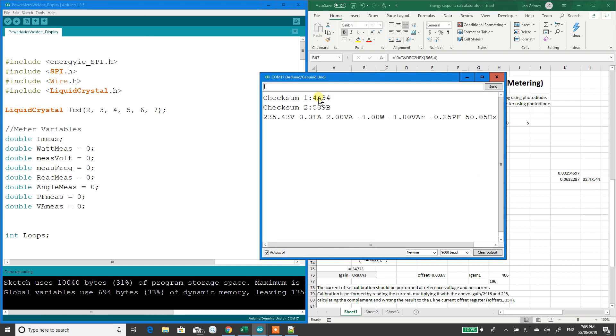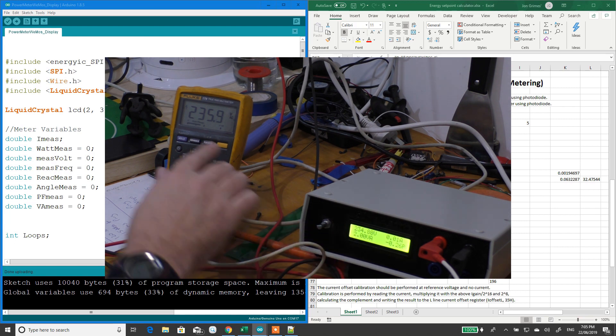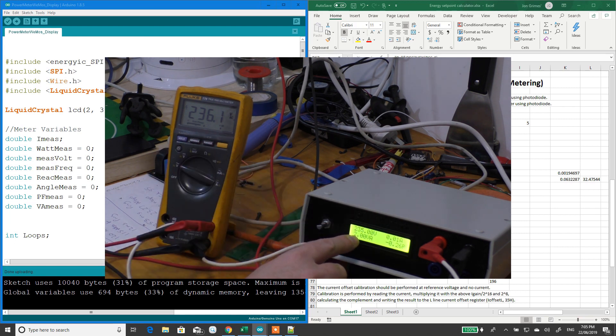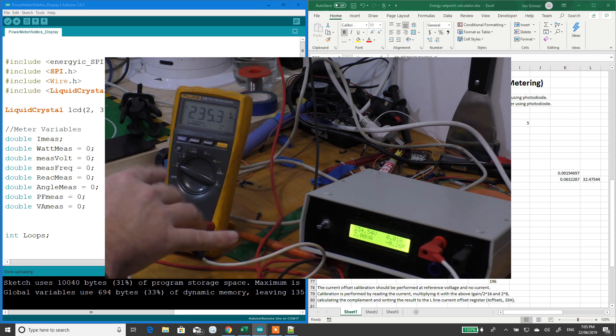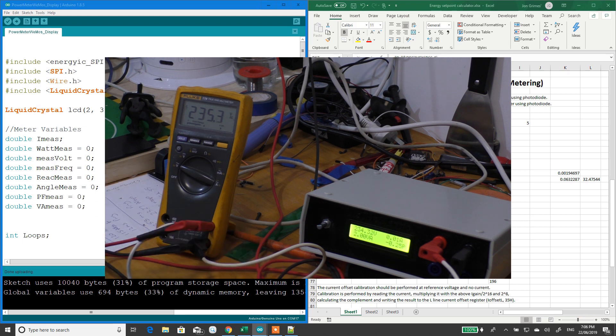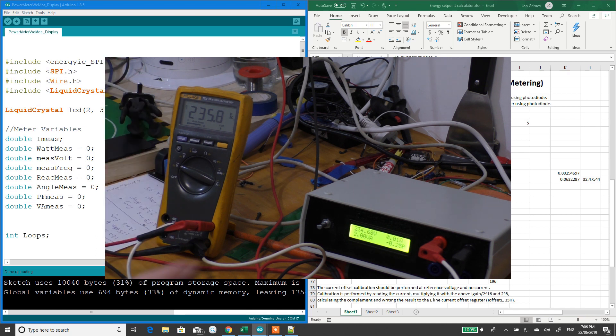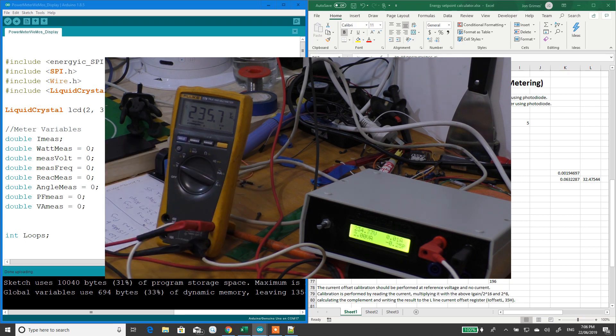If I look at the device I'm testing - I've put it through and changed it a bit. This is reading 235.9, and the multimeter is reading 235.0. The sample rates will affect it, so I'm just saying I'm ballparky - the more you play with it, the closer you can get. My original calibration was based on 63 volts. But you'll probably want 230, 240, or 110 volts if you're measuring mains devices.